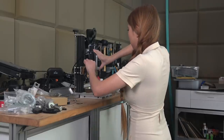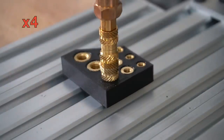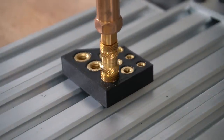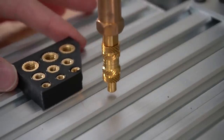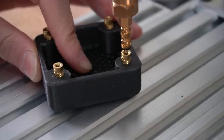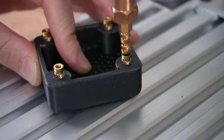In general, the best 3D prints are multi-part prints. It's like wood. Carving something out of one solid piece of wood is generally not the best idea because the grain influences the strength and surface finish. Same thing for 3D print layers. So just like wood, it's often best to make them out of a few pieces and attach them. That can be with dovetails or dowels and glue, or it can be using screws in a few different ways.